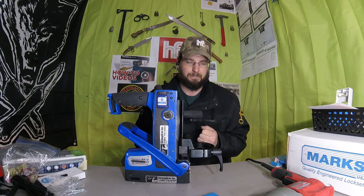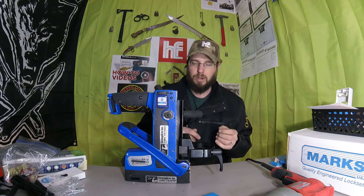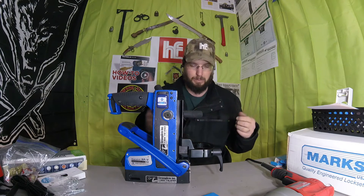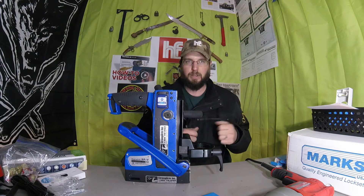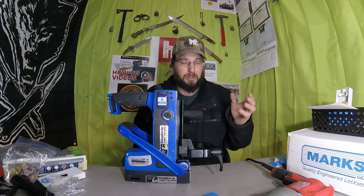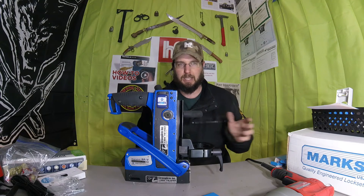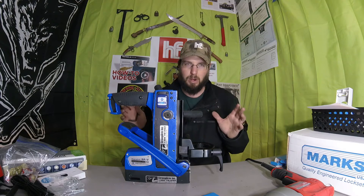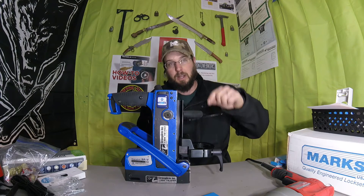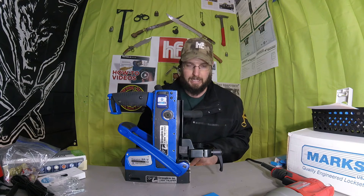One more point: with a bolt-on style rig with templates, you're limited to the dial ring area. With this, you can drill just about anywhere you need to on the safe. If you've done safe work for a long time, you know that bolt work comes undone, things become bound, people slam the door, something gets locked inside, or you've got a bolt that's disconnected, or remote relockers — and a lot of big-box store safes have remote-located locks. You cannot use your bolt-on rig for that. This lets you drill anywhere on the door — side, top, bottom, scoping, change keyholes — anywhere you need to drill, you can stick this on there, drill your hole, get it off fast, open your safe, get paid, and move on.